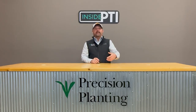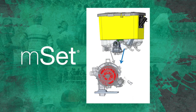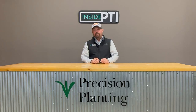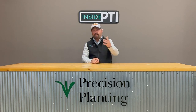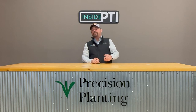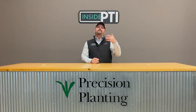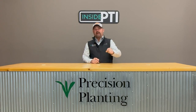In 2017 we released a new multi-genetic corn planting technology — MSET — for folks who wanted to shift away from VSET Select and bring in high-speed planting. Now we can change corn hybrid, change corn seeding rate, and plant it fast. It comes down to identifying soil variability. Here's a field at the PTI farm where we know we've got differences in organic matter, which means differences in water holding capacity, which leads to yield differences. Knowing that, I can work with my seedsmen to find the perfect corn hybrid to plant on each and every acre.